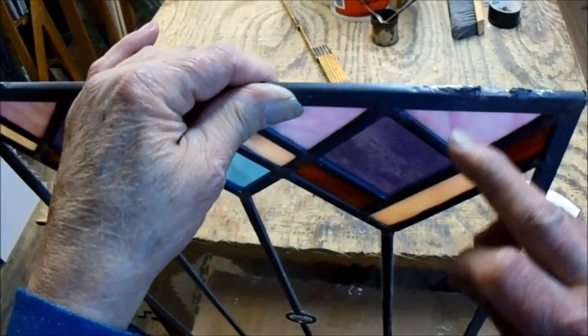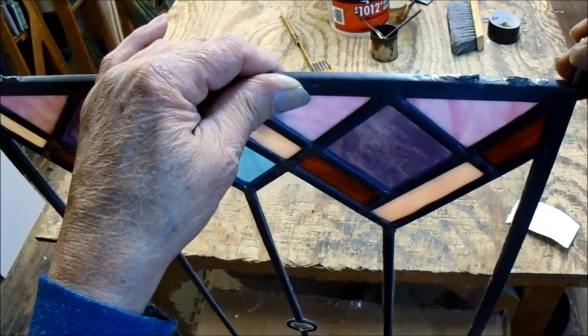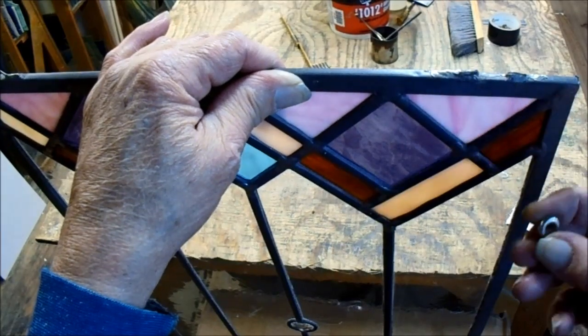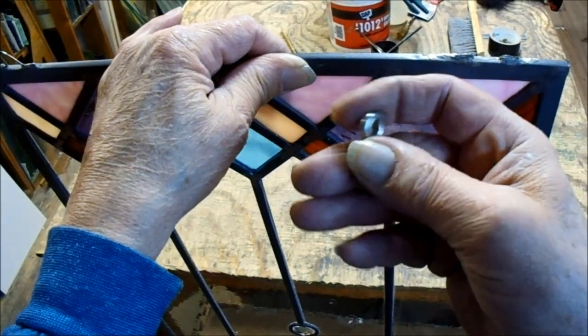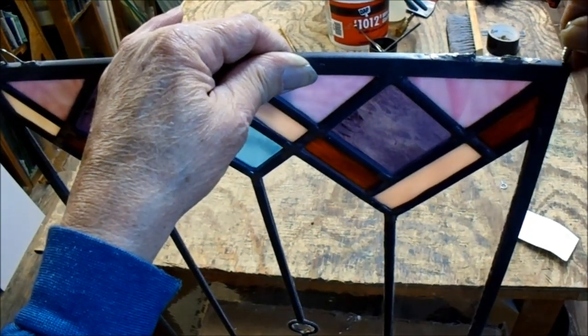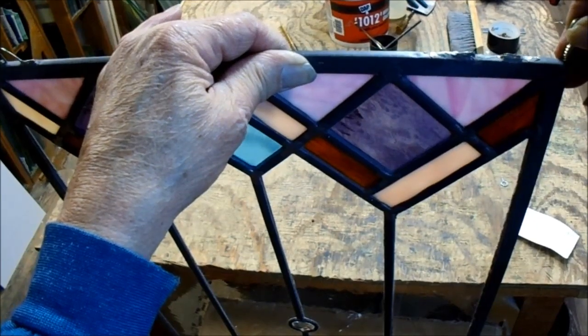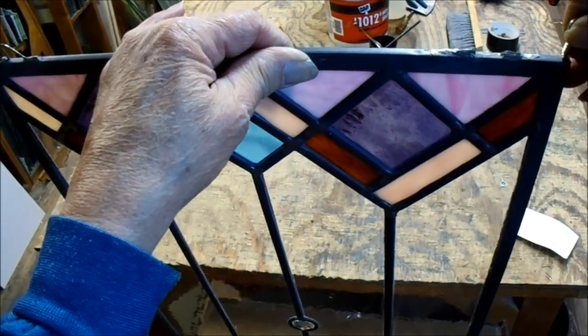What I told her I was going to do is take the hangers off and drill into here like I did in previous videos — tin this, screw it in, and solder the crap out of it. It's okay to lay the iron up against the tin screw eye so that everything soaks up in there.